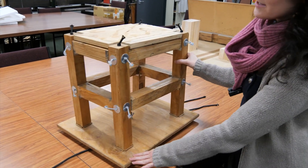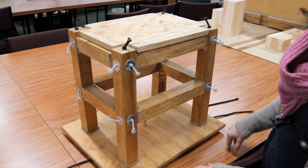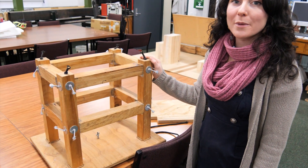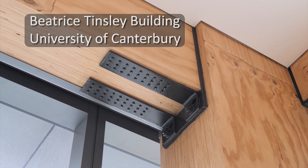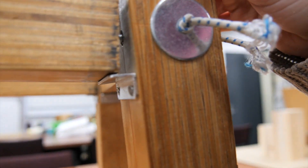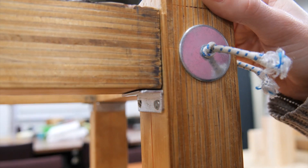When the shaking happens the building goes back to its normal location. Now that we've shown you how the building comes back to shape, I'm going to show you a close-up on things that we can see in real life buildings. For example, this L bracket here - you'll see that in the Beatrice Tinsley building - and what happens when the building shakes and moves is the building is able to open up and that bracket holds it into place.